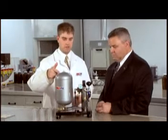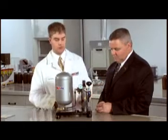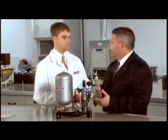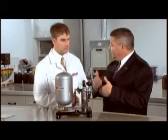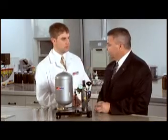And it's a very basic operation. It uses pressurized air from the air tank, and that air drives a ram which strikes the metal anvil below every time you push the plunger. So it's repeatable. It's the same every time, so no matter what grease you put in there, you're going to have a repeatable test. Absolutely. Very scientific, very repeatable, and an excellent way to show the resistance. Why don't we test some grease? What do you want to test first?